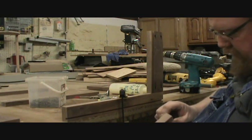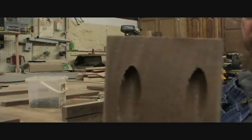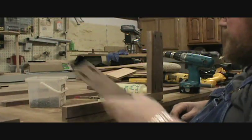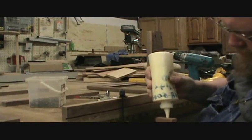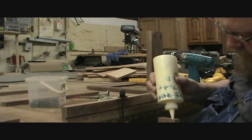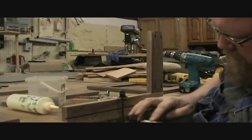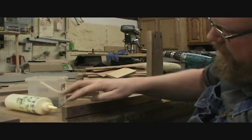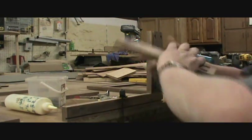And that's the other thing you got to remember too. I'm using what they call the pocket hole setup. And you got to remember, if you got a surface sander like I do and you use that to flatten stuff, you either A, got to remember to take the screws out so when you get sanded down, you ain't burning your sandpaper up. Or you just remember they're there.